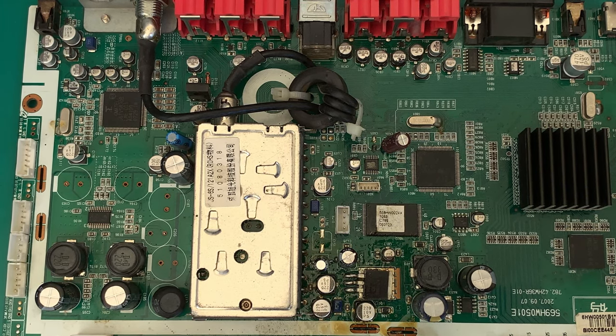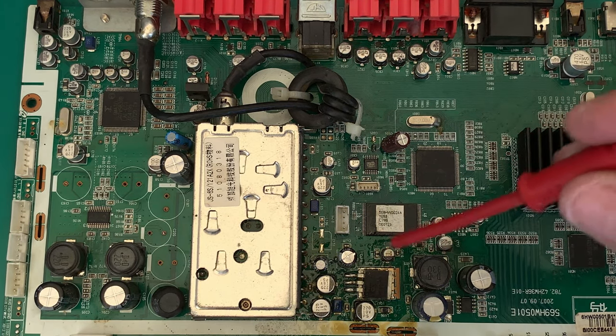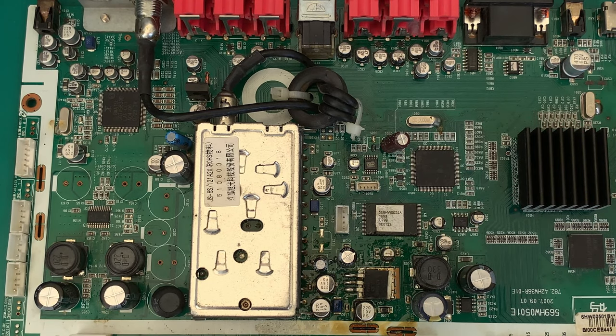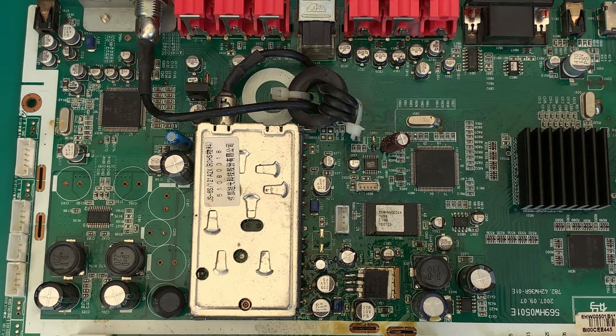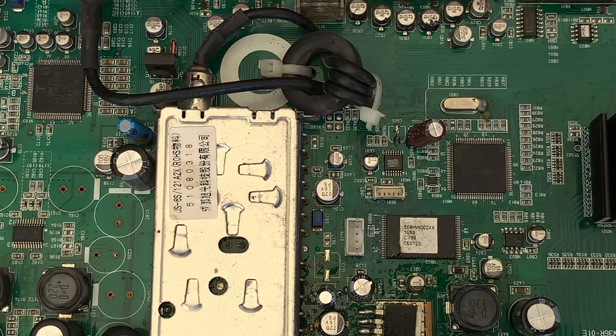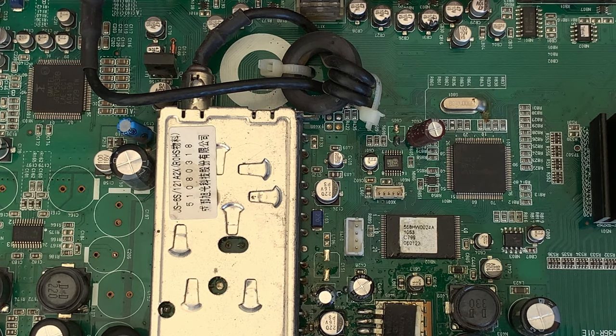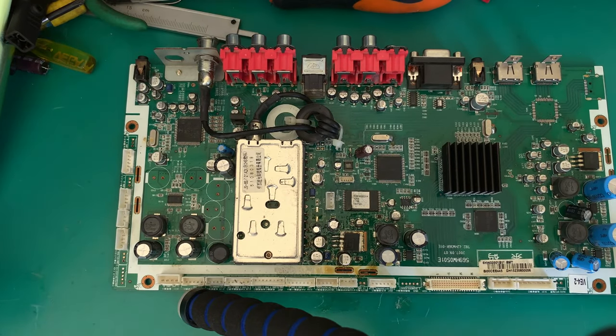What you can see maybe down here is there's a little voltage regulator, and clearly they've been in here, and I don't know, not the nicest of soldering. The only thing that I have done on this board is, let's see maybe if we can zoom in up a little bit up there. You'll see some of these capacitors, like this one, that one, they've got markings on the side, little black markings. I've just gone through this with my LCR meter and measured the capacitors to see if they're good. Why I've done that, let's just come out and give you a whole view of the board.